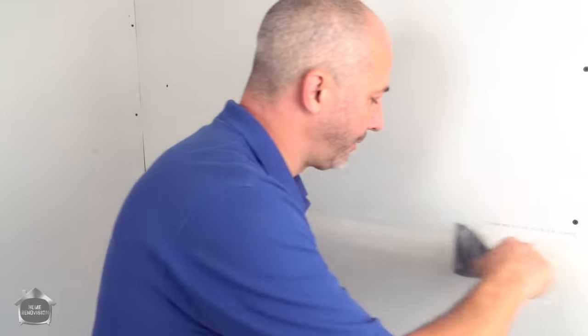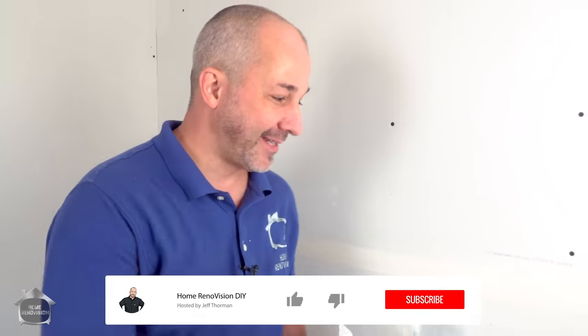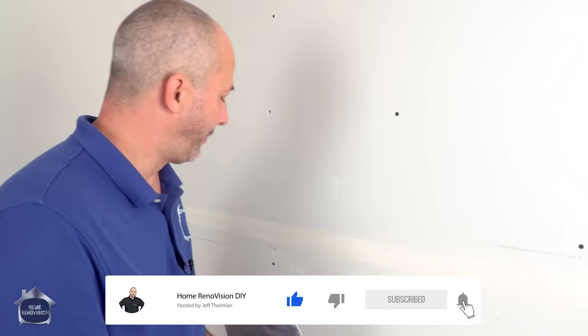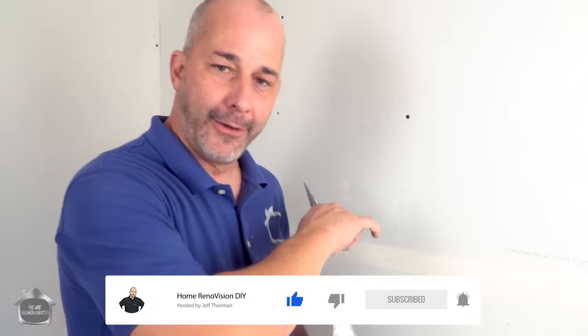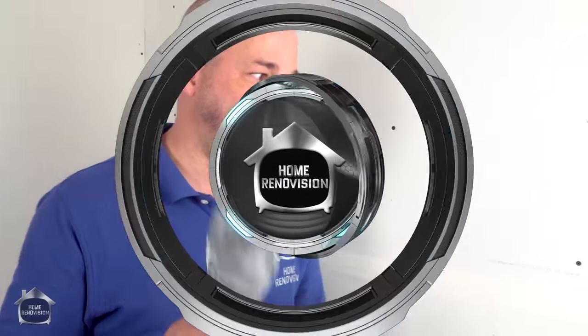Now I know guys that'll wet their tape in a little pail before they put it on the wall. That drives me crazy, because then it's already getting wrinkly the whole time you're working with it. I find this is a great way to do it, because it goes on dry, you can get it done quickly before it goes wrinkly, and you're not pulling it off the wall and stretching it out and cutting it over and over and over again.